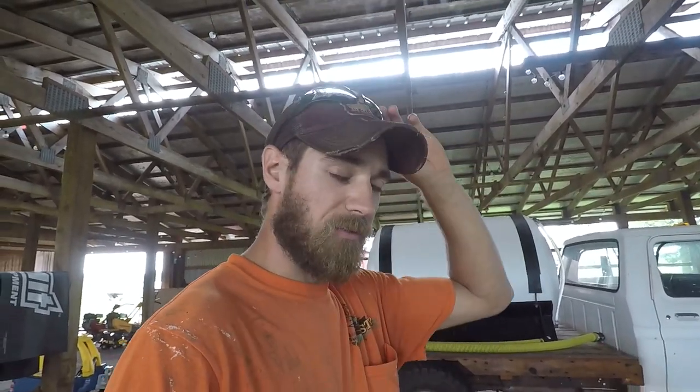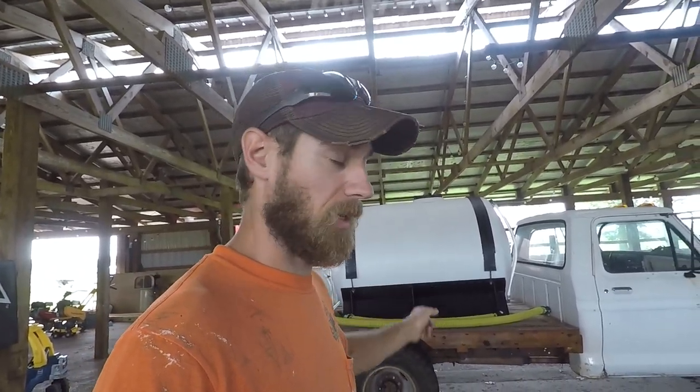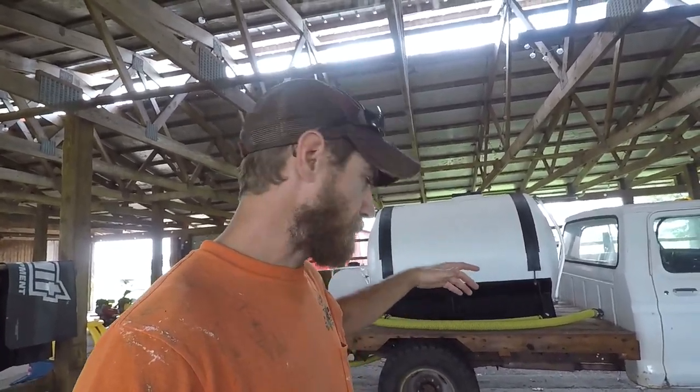I'll get a photo of it linked for you. But we were able to coat the tank completely with that, and it's an adhesion promoter, effectively, specifically for polypropylene, because this is a polypropylene tank. Once we did that, within 30 minutes you have to have your first coat on, and so we painted the whole thing black, a grand total of, I believe, 4 coats of black paint on this tank, and that completely seals out all the sunlight.